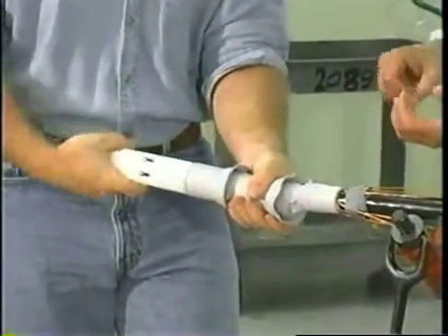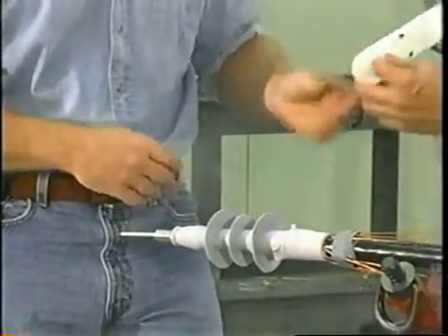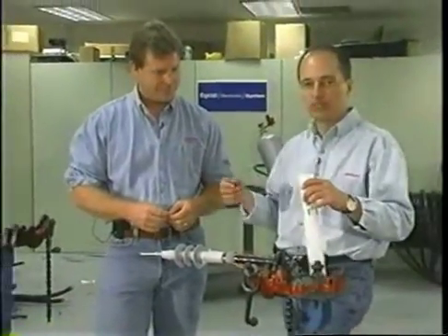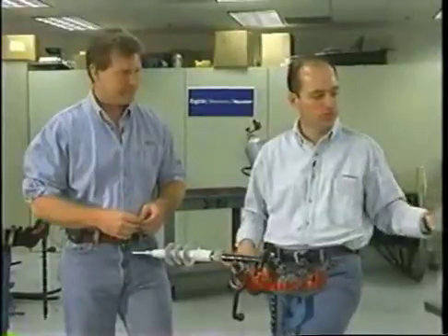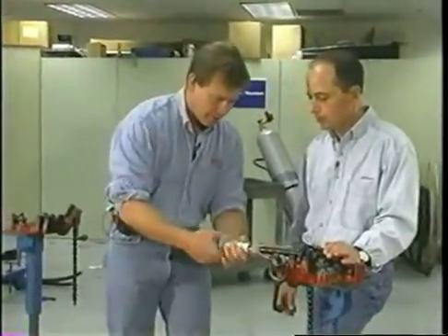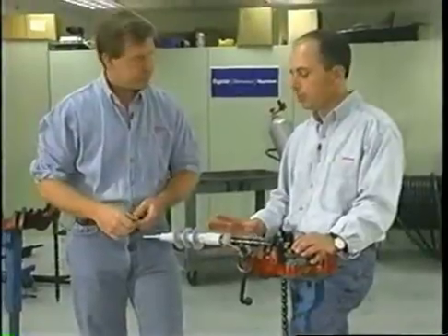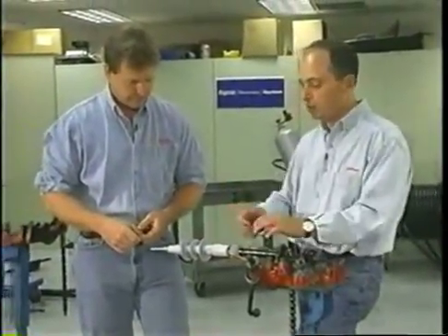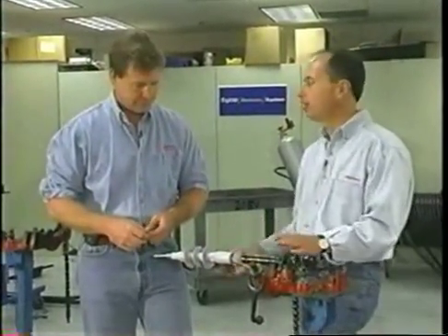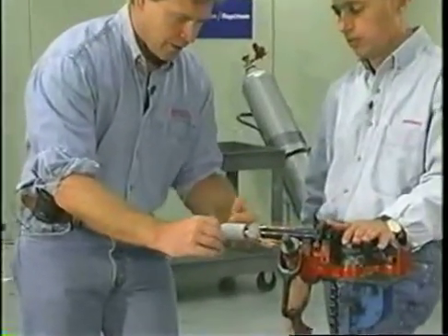The patch has already been applied to the semi-con cutback. Here we simply just want to position the edge of the tube against the neutral wires, right up on the jacket, and then simply start to twist the holdout tube. So you just twist it and pull it out — is it hard? Very easy operation. It looks like it's pretty easy. And this is ABS, so I guess it's recyclable — versus that other big spiral, that very long spiral. Probably a lot of garbage involved in that, and this is totally recyclable. In this case, I've actually installed the termination in the correct position, but if you needed to, you can actually slide this termination into the correct position, so you can reposition the termination. The other kind with the big spiral, once you pull that spiral out, it shrinks down and it's locked in position, so if you got it wrong, you got to cut it off, right? That's correct.